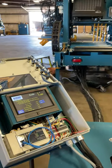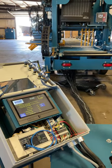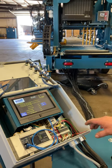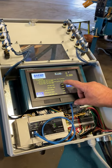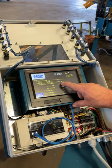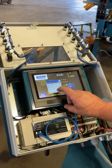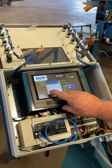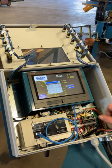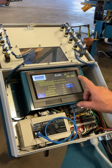You have to measure your blade. You go from the bunk up to the bottom point of the tooth. I've already got it set at one inch. I come over here and tap this zero for low scaling point — 1.000, you see it right up here. I hit enter, then I come over here and hit enter.